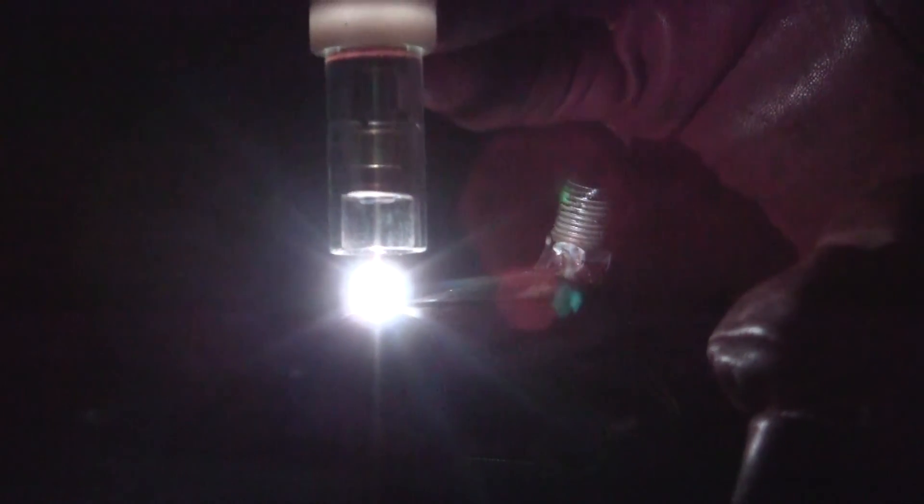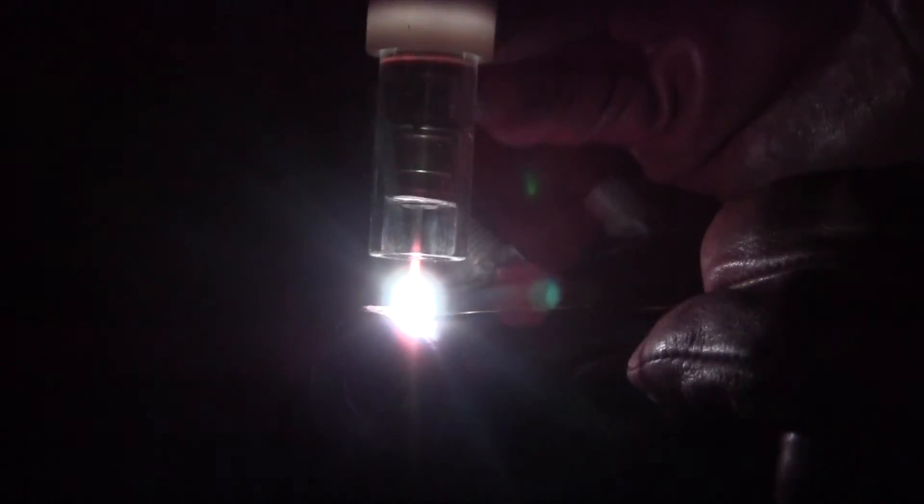The silicon bronze is good for joining two different materials. This time I'm using the same — both steel: the steel fitting and the steel tube. Watch your heat when you get ready to do the end cap, because it's almost a corner-to-corner weld and all your heat has nowhere to go. This is where you'll pop a hole or it'll drip away and you'll lose control, so you really have to watch your heat. Try to keep it as flat as you can. Even though you're going on a circular bead, try to stay up on top — this is when you want to turn your tube and keep it from going downhill as much as you can. Remember your stops and starts: before you go past your stop, make sure it's filled in right there, because that's where you'll come back with a little pinhole.